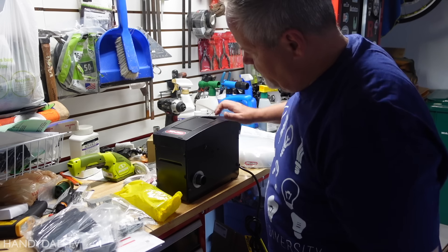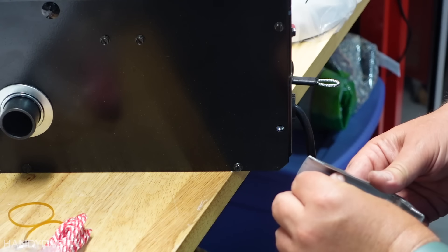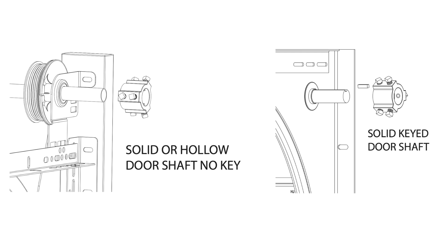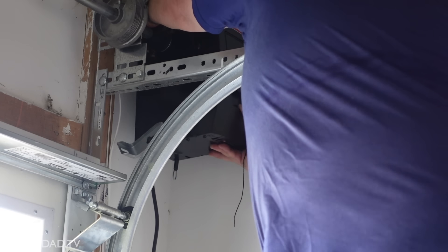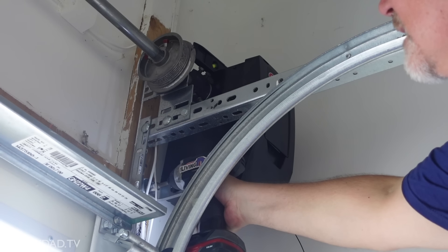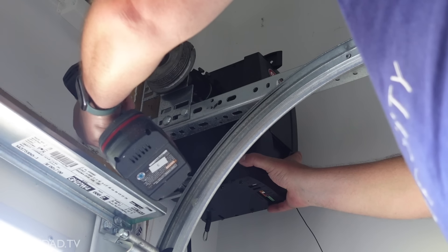The opener can be installed on either side of the door. I chose the right side because I could use an existing outlet for power. I installed this L-bracket on the left side of my motor, which will be facing my door. The motor unit attaches to the torsion shaft with a coupler that works for keyed or non-keyed shafts. Mine was a hollow shaft with no key. With a level on top, I made sure the unit was straight before securing the L-bracket and coupler bolts.